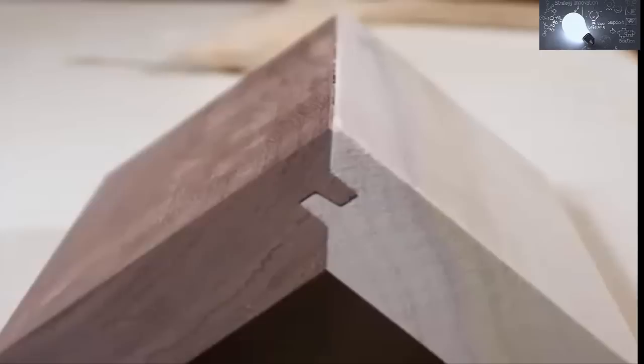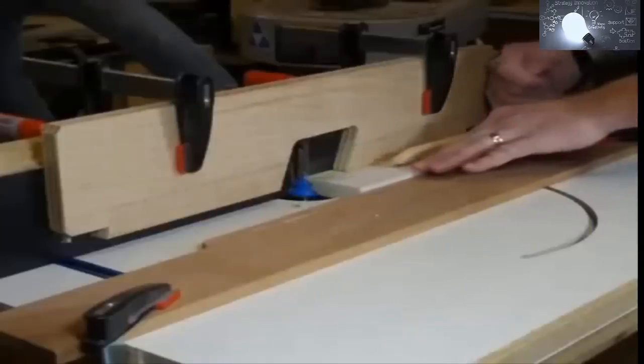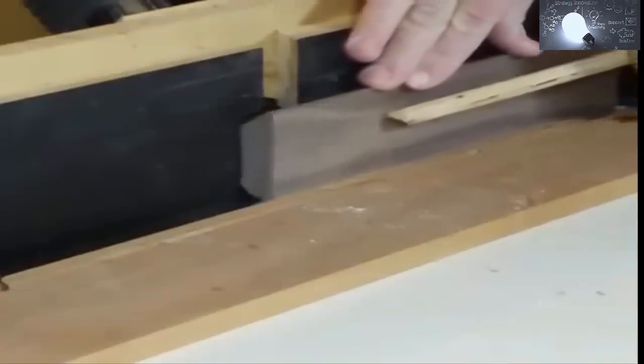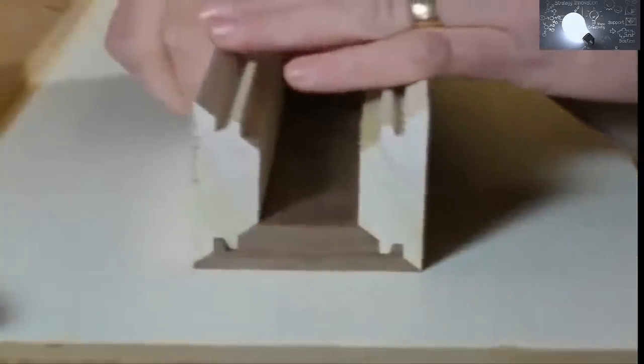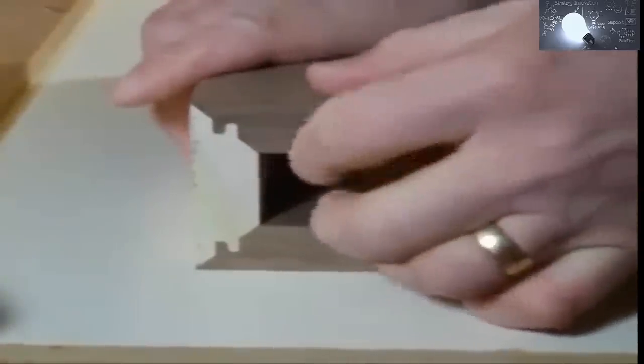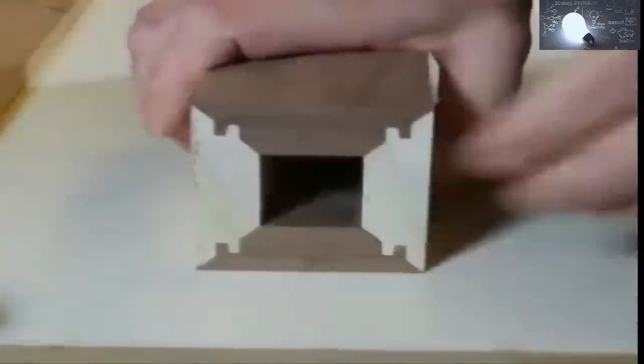Once the sharp edge is properly cutting, adjust the fence and height to shift the tongues until the joints line up. The main stock can now be milled. Each joint requires a horizontal and a vertical cut. Properly milled joints are very tight, and clamping is easy since the tongues keep the joints from sliding. This bit will earn its place in your router bit collection.